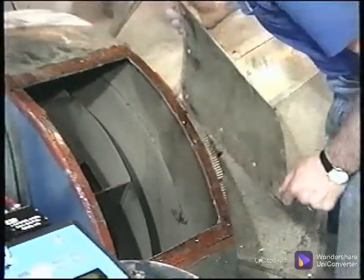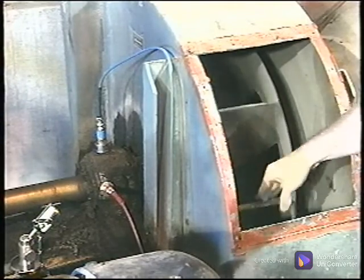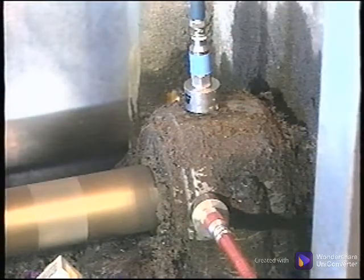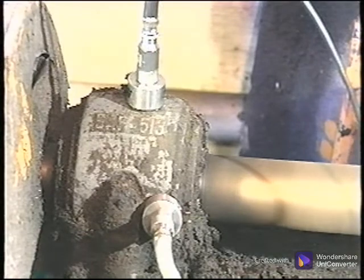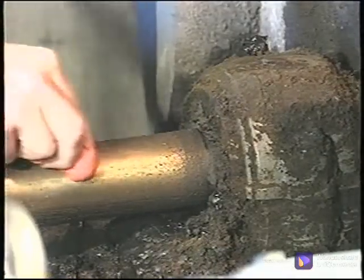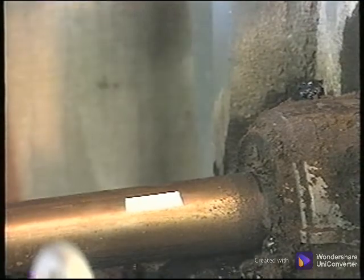When the fan is stopped and locked out, the rotor can be inspected for buildup and broken, loose, or missing parts. The rotor is clean and does not need additional cleaning. Now the balance job can be set up. A horizontal and vertical reading are used at each fan bearing with a sensor at each measurement point. These will not be moved during the entire balance job. The balance program will perform the calculations, minimizing the vibration at all the measurement points. Select a convenient location on the shaft, trying to place the reflective tape in line with a known component such as a fan blade.